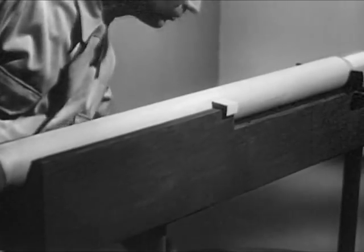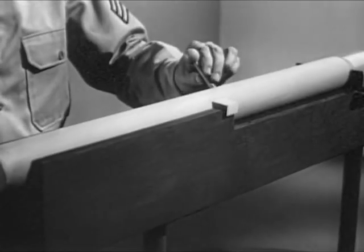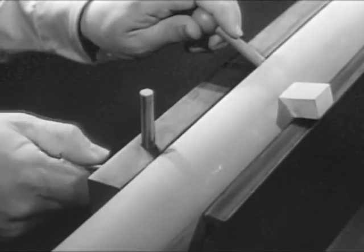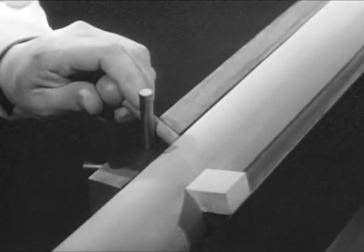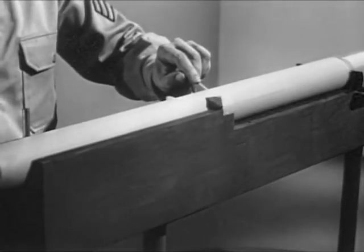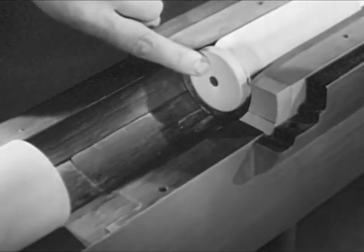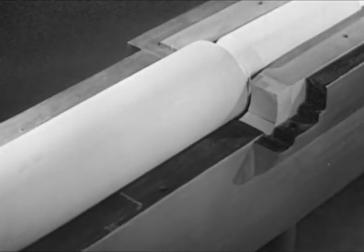It can be made easier by adding a handle to move the bolt. The handle can also be used to strike this stop. This prevents the bolt from sliding out of the receiver. With the bolt closed, how are we going to fire the cartridge? To fire the cartridge, we must strike the primer. However, the bolt is in the way. Apparently, we'll have to go through it.